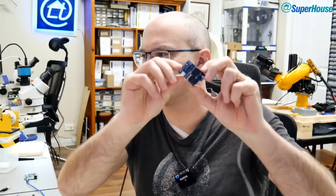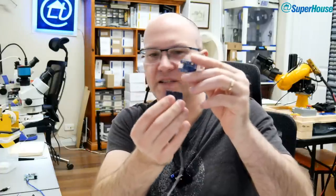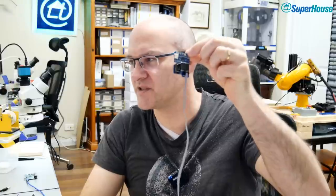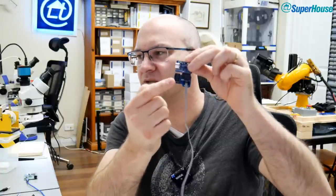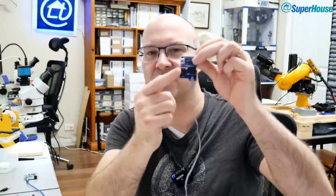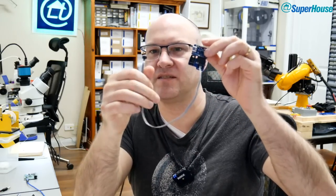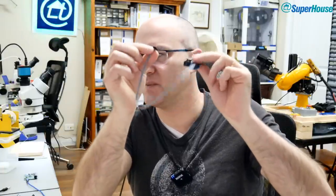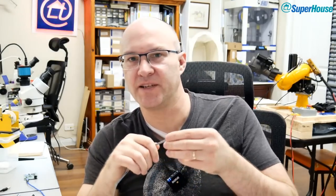ESP Flasher is complete. So that's the ESP Flasher, and that's the ESP Flasher adapter. Not the greatest camera to be showing you this on, but this gives the 1x6 0.1 inch format header. Plug it into this, and now it's got 2x3 IDC headers in both 1.27mm and 2.54mm, and also down the bottom, not populated, 1x6 in 1.27mm. So I've been using this with the tiny little 1.27mm pitch IDC cables on a few projects now. Over the last 2 weeks, I've brought up several new boards with this connector on it and used this programmer, and it works brilliantly.